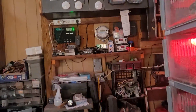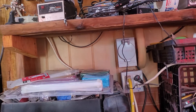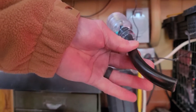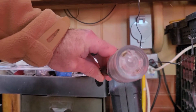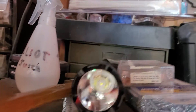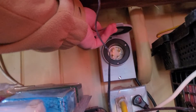What I needed to do was get this into my power box. The unit I bought from Home Depot is a Reliance transfer kit. I'll show you that downstairs — it comes with a box, a cable, and some cord. I cut the ends off this cable because I wanted to use it to go from here to the power box. I'm going to make a jumper using this because the transfer switch is set for 110 or 220. So you have a four-prong connector, and there are four wires on that one.